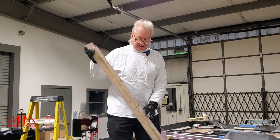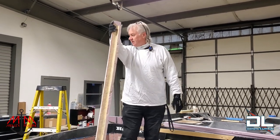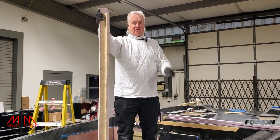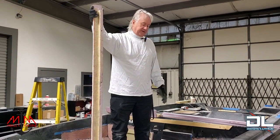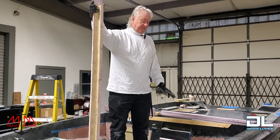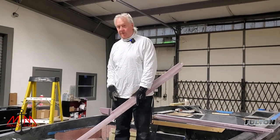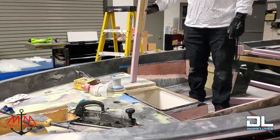We're going to be putting this in place using our glass mix — thickened epoxy. We're going to use a mixture of straight epoxy and thickened epoxy to put these in place, and then after they're set, we'll go back and glass over them, blending into the existing structure. We have experience doing this now from the ice chest, ice locker modification.